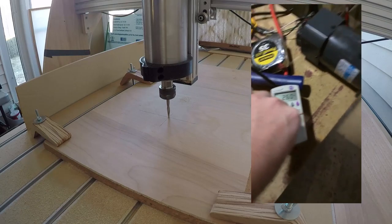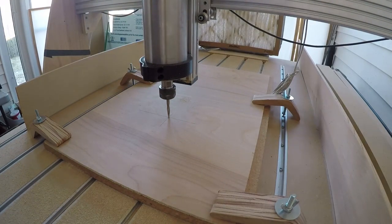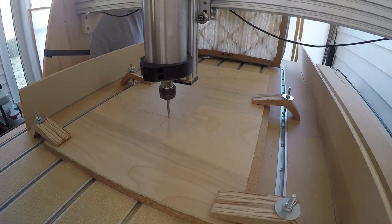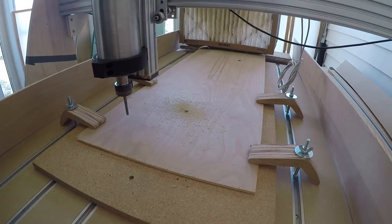The motor got up to full speed, drawing 2.5 amps of the allowable 3, with an impeller that was 12 inches in diameter and 2.5 inches deep. Now that I know the size of the impeller, we can start cutting the pieces out. I used quarter-inch birch plywood purchased from my local hardwood store.